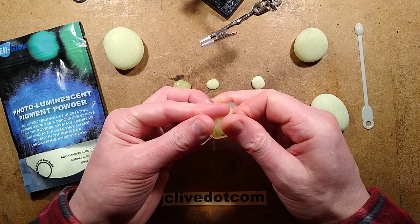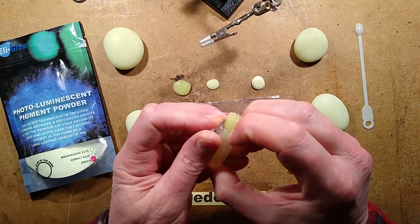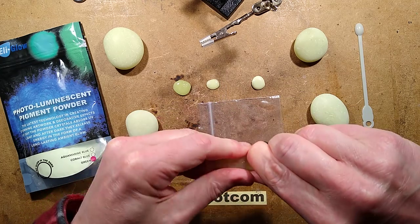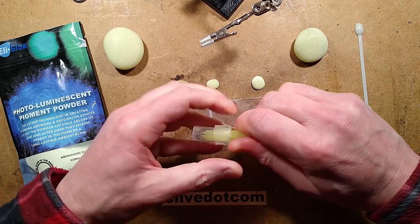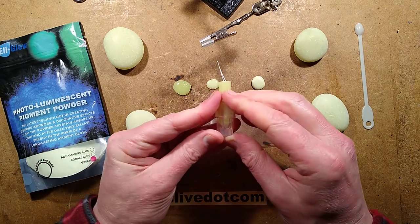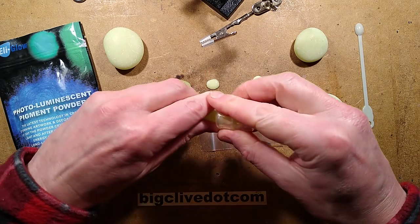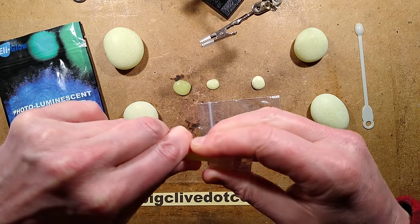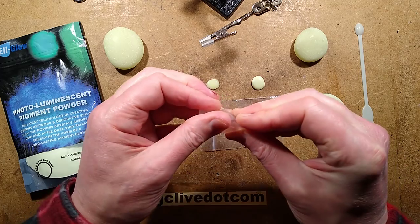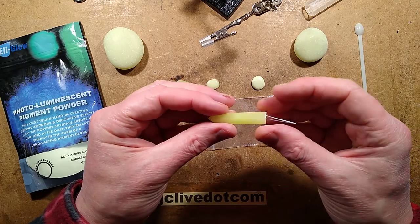Although I'd want to get multiple uses out of the mold, this is really proving tough. It's kind of going inside out — it is kind of coming out — or maybe not. In the commercial fiberglass industry they'd have a compressed airline point to create an air cushion and allow it to pull out easily. But it is coming out — there we go! We have our obelisk. I'll just flip the mold back into the correct shape so it doesn't take a new form. It looks quite smart — there's a tiny bubble but no obvious imperfections.